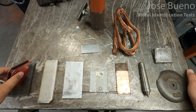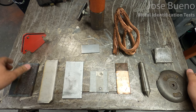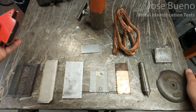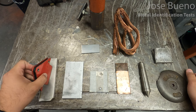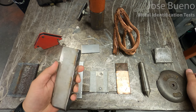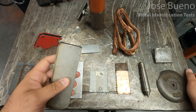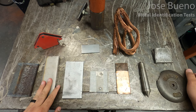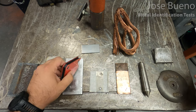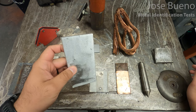We're going to test this piece over here with the magnet, and we can see that the magnet does stick — we can pull it up off the table. So that rules in favor of this specimen potentially being carbon steel. Now let's test the second piece of metal. The magnet does not stick; it doesn't pull it up off the table whatsoever. So we can start ruling this piece out as being a potential carbon steel specimen. On to the third piece of metal — the magnet also does not stick, so we can rule this one out as well.